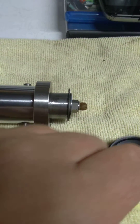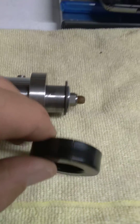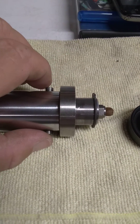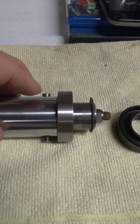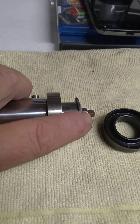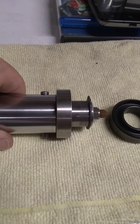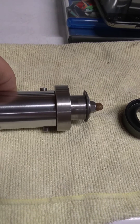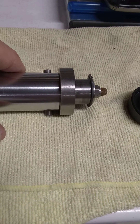I do need to replace the seal, because it is well cracked, as you can see. But if you have a problem with your floor jack leaking down, it could be this seal here is not sealing well. When this pin is pushed forward on both sides, air or fluid can pass through in both directions. That's something to look at if you have a bleed-down problem with your made-in-Japan Sears or Craftsman Floor Jack from the 80s and 90s.